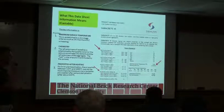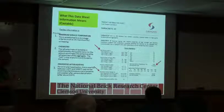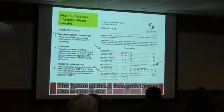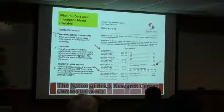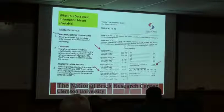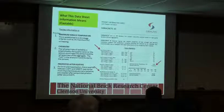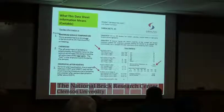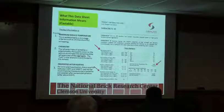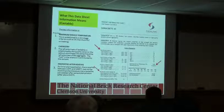And you even have to be careful on some of them. Again, understand the product you're using. There are some out there that you can sweeten when using it, and there are some that you do not want to add water to at all. That will come in a pre-mixed can. A lot of times when you pop the cover on it, it'll have almost like a black oily film on top of it, and you want to just get that stuff mixed back in. Same on mortars, going through the pre-mixed stuff.